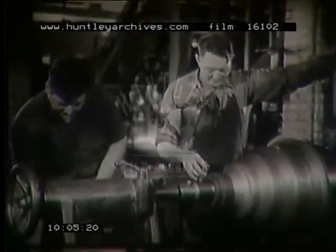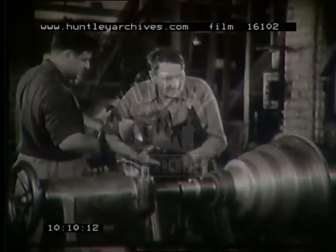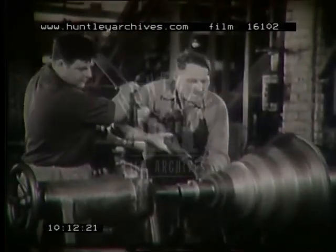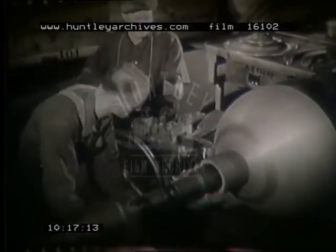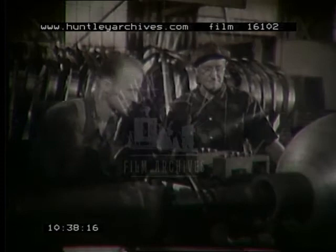So far, we have been considering hand spinning only. Remember, there are two other methods, semi or partly mechanical, and mechanical. The semi-mechanical method differs principally in the application of the tool to the work, it being controlled by two feed screws, the wheel to the left, moving the tool back and forth along the work, while the wheel in the rear moves the tool in and out, following the contour of the chuck. It takes less strength than hand spinning, but does require considerable skill.